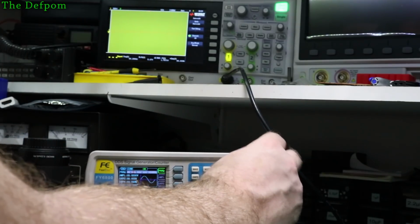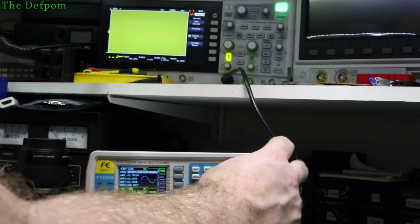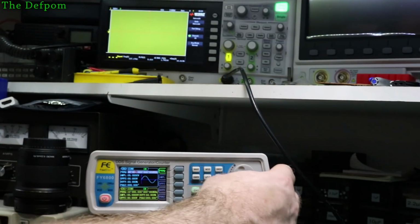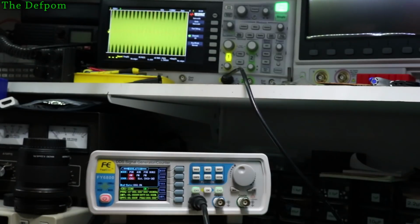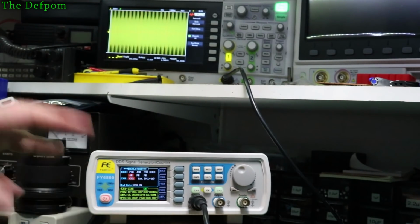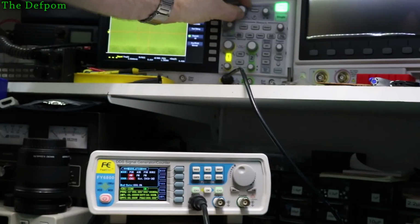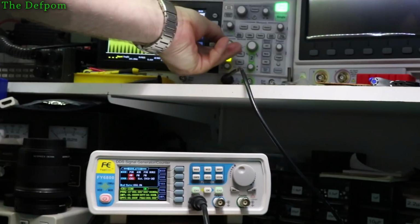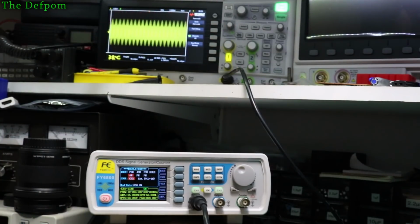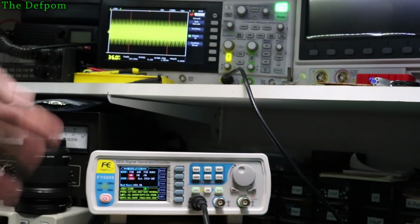Channel 2 sine wave, 10 kHz, let's go. 1 kHz modulation. I've got modulation now. So maybe that's the little thing I'm missing there, is having to go into channel 2 and set the modulation level up on there, then go back in again. I don't know, maybe that's what I'm missing, but now there's modulation. The scope's not triggering very well, but it's there. I don't know, it's just some weird thing. If you're using modulation, I mean obviously it works, but it's a little bit glitchy.